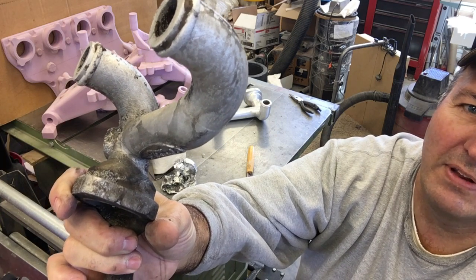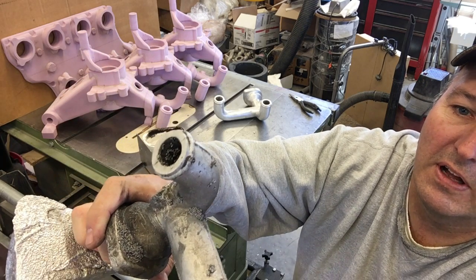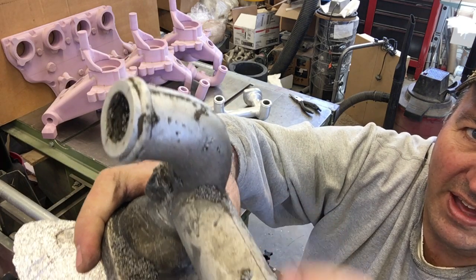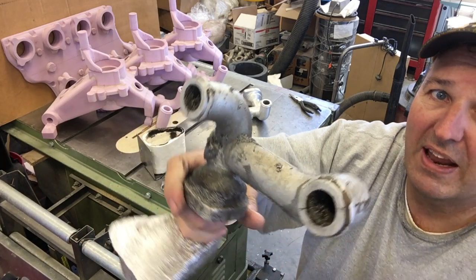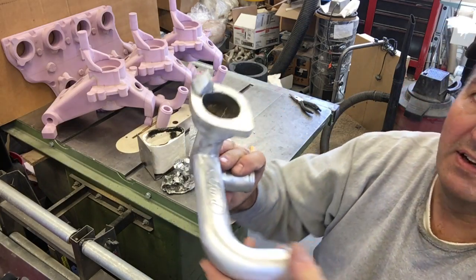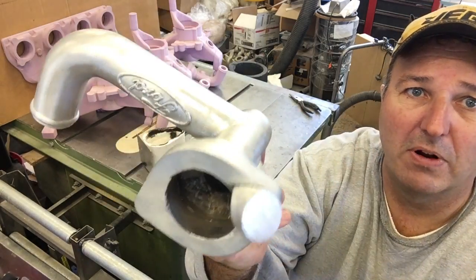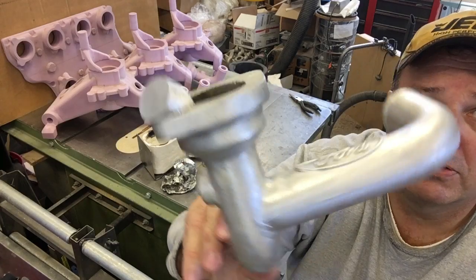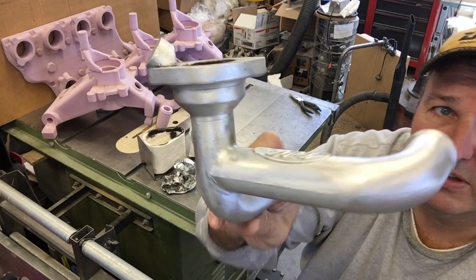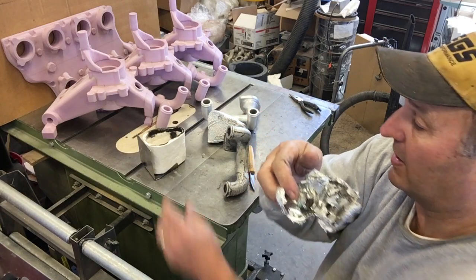It's kind of interesting that they've penetrated through the coating, but the coating and surface finish seems intact underneath them. I'll do a little more work on this casting where all these little penetration boogers are. If this was just a gravity-fed casting, I don't think you'd see any of that at all. On this one from yesterday — after hitting it with a wire brush just to clean it up — cosmetically it's basically every bit as good as the pattern was, so yeah, it's kind of an interesting outcome.